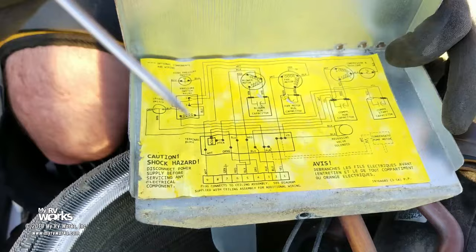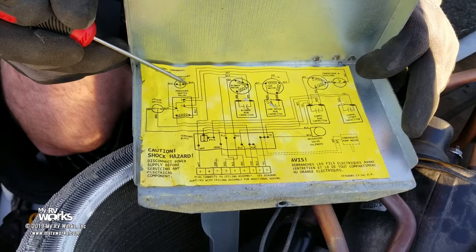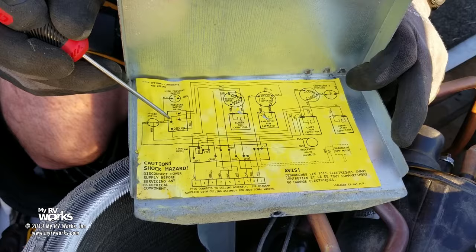But we're going to follow this black wire. Here is where our trail splits. And remember it turned blue. This one was blue. He goes up here to our high pressure switch. And if the high pressure switch is made, then I'm going to allow power to come back down through here, landing on this guy right here, which is really not going anywhere other than energizing my coil. The other end of the coil is going to be my common.